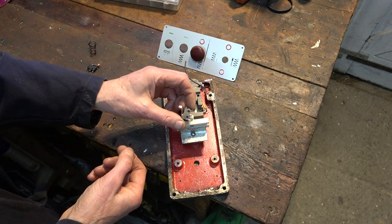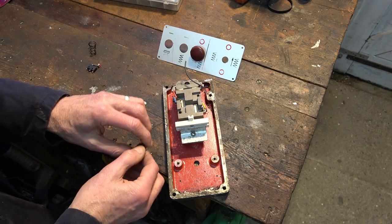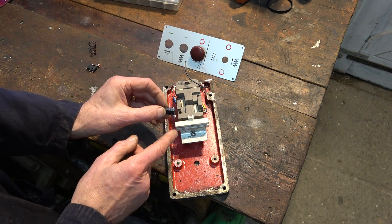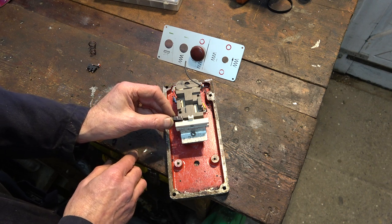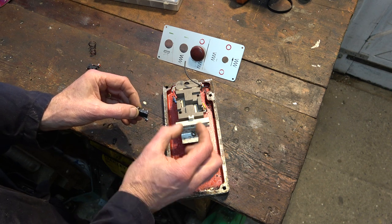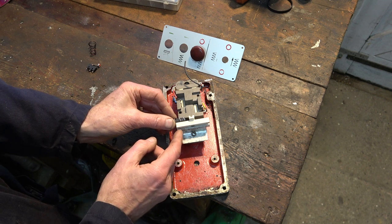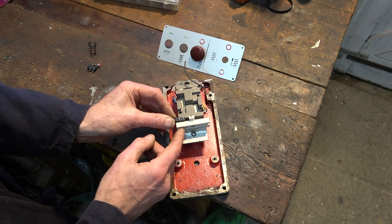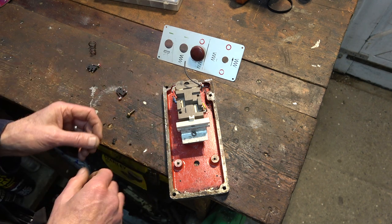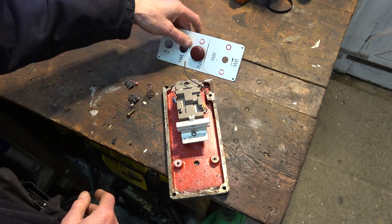And then I've got two small micro switches, because this is only single pole and I need at least double, and I'm looking for triple. It's the stop button, normally closed. So I'm going to put those micro switches there such that when you press the button, a flat plate comes up and it'll press these in. Now, at this point, I'm waiting for some 2.5 millimeter machine screws to come, which I ordered quite a while ago, but we're in between Christmas and New Year. Everything seems to be going slowly. So I'll have to park that for a little bit.